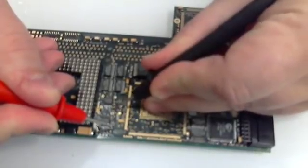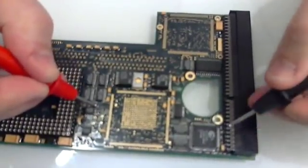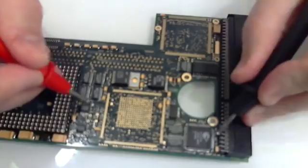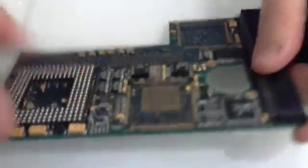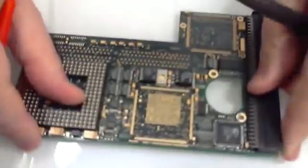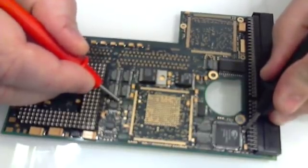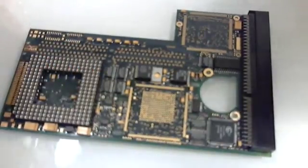The PPC is not there but should work anyway because I have a Cosmos ROM that works without PPC. Here we have the ground pin, another ground pin — totally dead. Here we have the output pin of the oscillator, and it should go. That means you have layers on this pin. You can't see anything on the top and bottom, but in the inner layers — yes, working. That's what I verified.